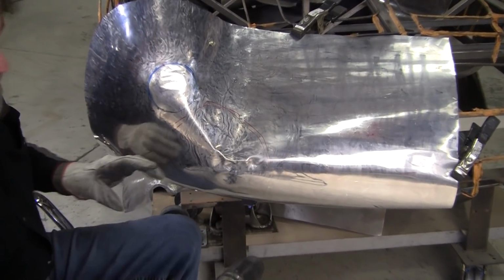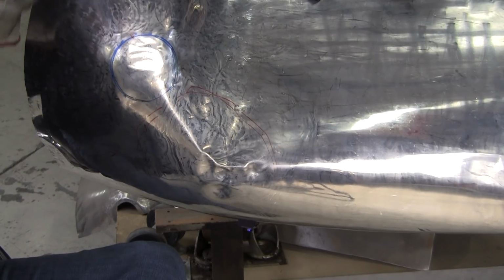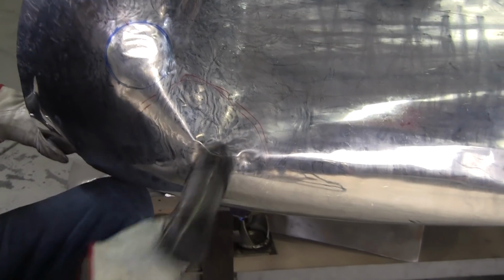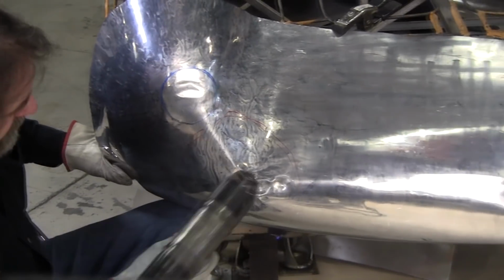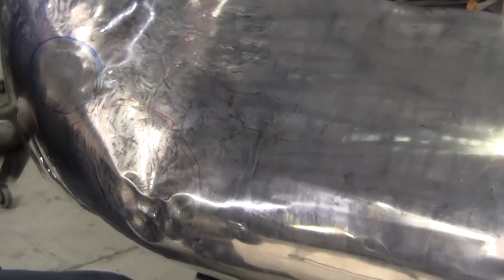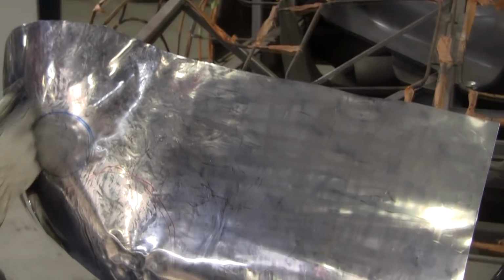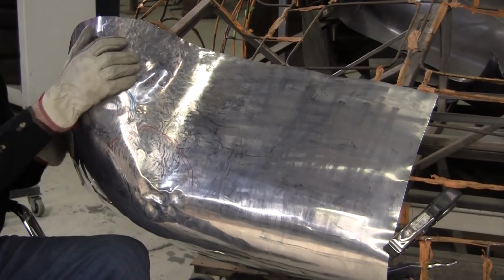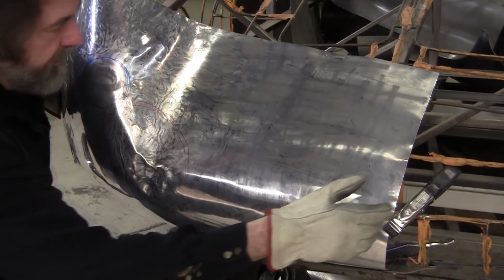Now, if someone had a hammer form, a full surface 550 body buck, that's what they would be doing. They can do it cold like that. Yep, there we go. We popped. We got a little good shrinkage though. So let's do the shrinkage again around here, and that should pop it up nice. We've got this valley working really good. That's almost where it needs to be.